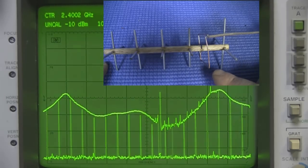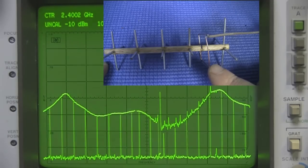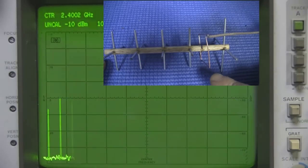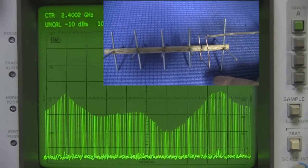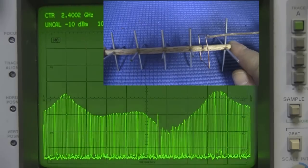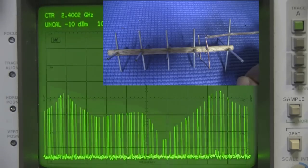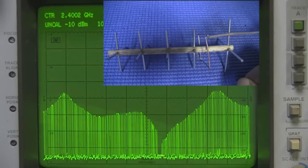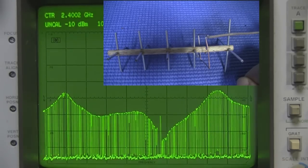At the moment I've got it lined up with the black line on the boom — the position I used in the previous X-Wing video, copied from the Yagi antenna I picked up. Refreshing the spectrum analyzer — there's a nice response with a nice dip to it. Now I'm going to move the driven element a little bit closer to the first parasitic element. Moving it closer, we're getting a much nicer frequency response — you can see how it dips down — that's going to be an extremely low VSWR, and it's also moved the response slightly in frequency as well.